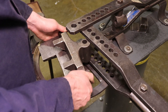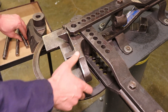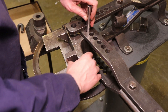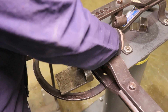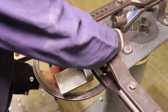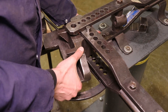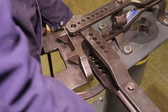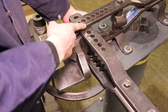First, I'm going to swing this over and bring it a little closer to make things easier. I'll grab one of these wrist pins — the pin with no head — and go in that second hole. Before I let go of that pin, I'll put a finger underneath the machine. You never want somebody else's hand under there — always your own, so you don't pinch someone else's hand. I'll give it a wiggle until it drops in place, then carefully wiggle it so that pin gets captivated.